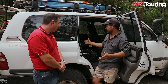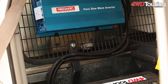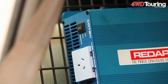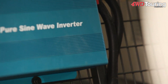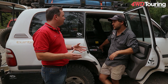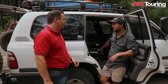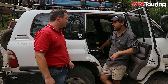In the front here we've got a pure sine wave inverter from you guys. Now I know these things cost a fortune and I'm told that I need one to run all my camera gear and laptops and everything else. What is the difference between this and what you buy at Dick Smith for 100 bucks? So you've got a 1500 watt inverter, able to run quite a bit of equipment. With the pure sine wave it is ideal for sensitive electronics — laptops, camera equipment and the like. Because it has a pure sine wave it's just the same as if you're plugging in at home or in your office. Essentially what you've got there is your mobile power station. The modified sine wave can heat things up and even damage some of the sensitive electronics.